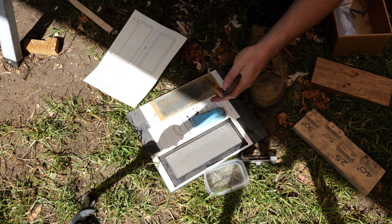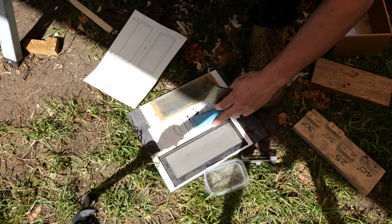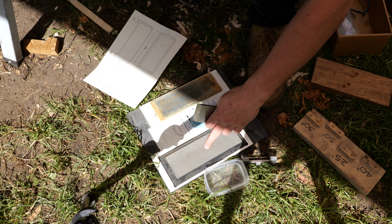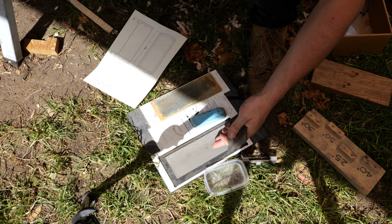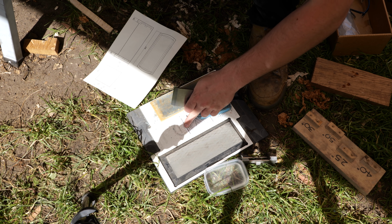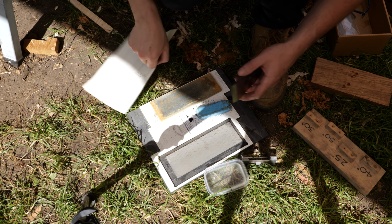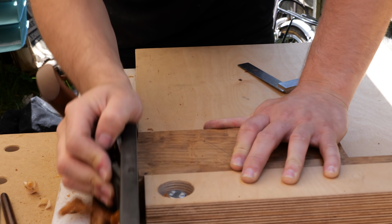And on the subject of cheap tools, another thing I'm often asked is, what's the best sharpening setup for a budget? And for me personally, I haven't come across anything better than this, which is the Axminster Rider sharpening station, double-sided diamond stone this side, 1000, and then 400 on the other side for some rough grinding stuff, leather strop, paste, and a sharpening base, which is cool. It's definitely not needed, but these two paired together are really good, and you can get a very sharp blade from this. It's blooming awesome.